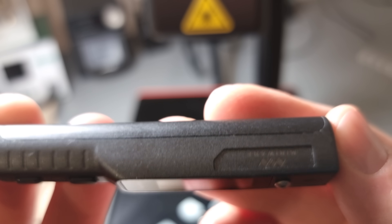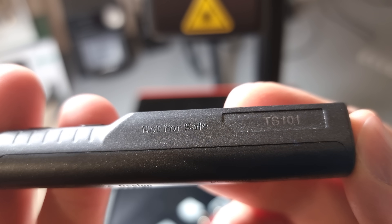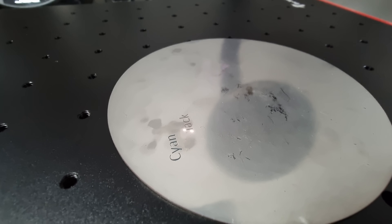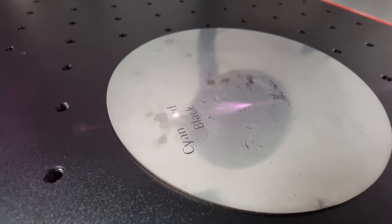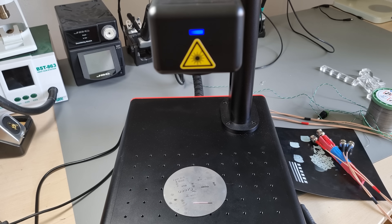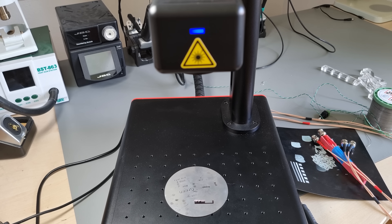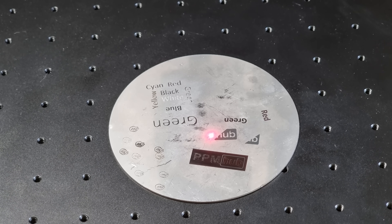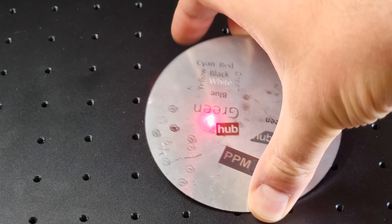Here's a counter example: disfiguring a beautiful TS-101. Can you tell which markings were made correctly with a MOPA laser, and which are either from a hot stamp or a heavy-handed Q-switcher? The most famous feature of MOPA lasers is of course color engraving on stainless steel and titanium. We have such tight grip on the laser's parameters that we can make it dispense just the right amount of energy to grow a nanometer-thin oxide layer on some metals, which interacts with reflected light and makes it seem like it has a color. Absolutely no explosive impulse energies — just very precise localized heating. This might be a bit of a gimmick feature because it's purely decorative and needs lots of fine-tuning per material, and the thin oxide layer is not really stainless anymore — it is chemically vulnerable and might need a protective coating if it is to last.